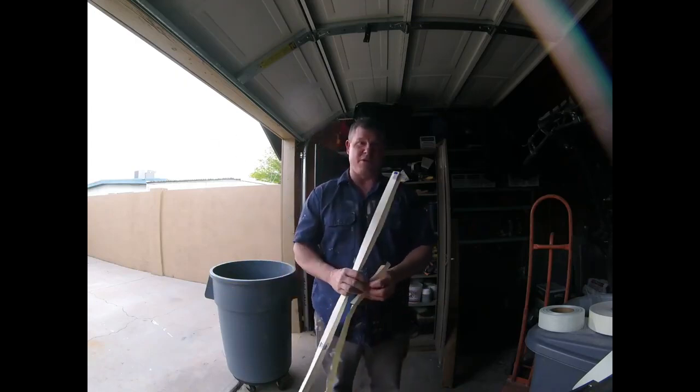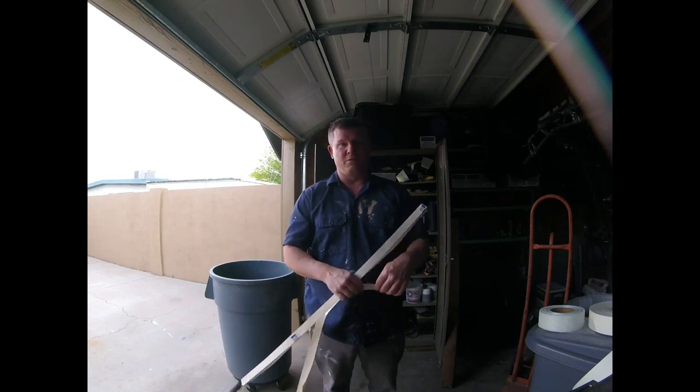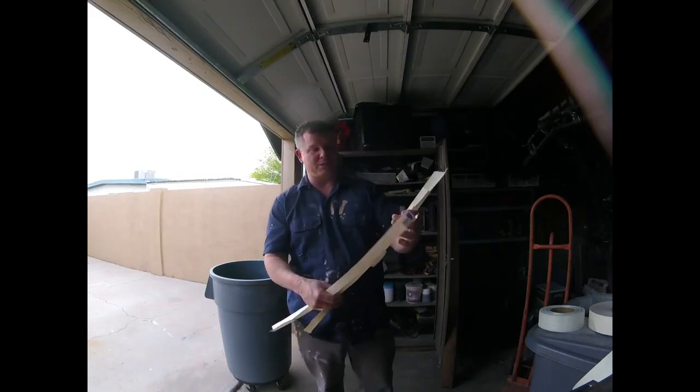There's a technique in my other video on how to work with the hot muds. We usually do a wet knife slicking process, which requires a 6-inch knife and a damp sponge where you slick out the hot muds before they set up. But that's enough with the hot muds. That's a whole other video.